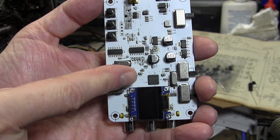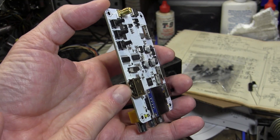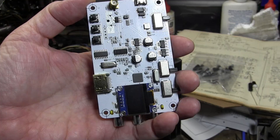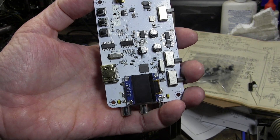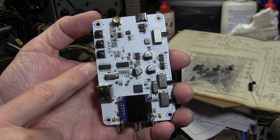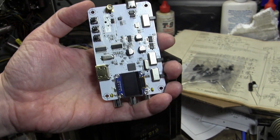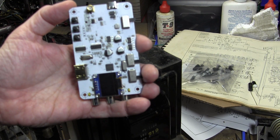That chip is an HDMI converter — it takes a digital stream coming in on this connector here and decodes it essentially to composite video and audio. The other chip is a microcontroller based on the venerable 8051, going way back to the late '70s, early '80s.